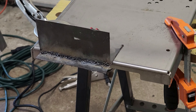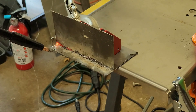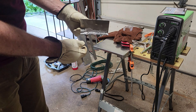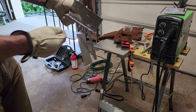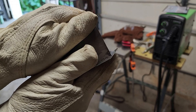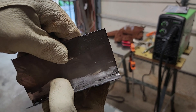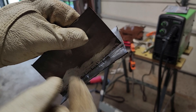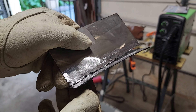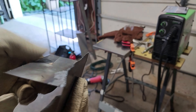Second attempt is not looking much better. After grinding it down, it honestly doesn't look terrible for really a first weld. It straight up burned right through some spots. It's breaking over here, which I think was the less penetration, low heat where I didn't have enough heat going into it. But over here, I had too much and it is actually holding in some spots.